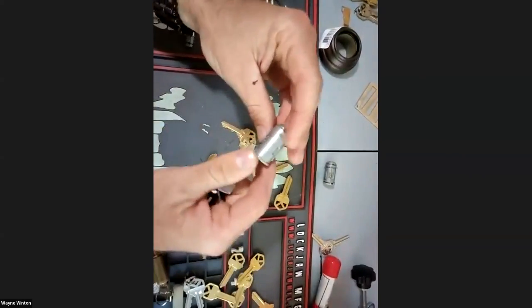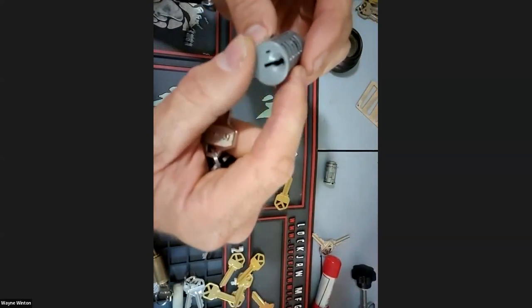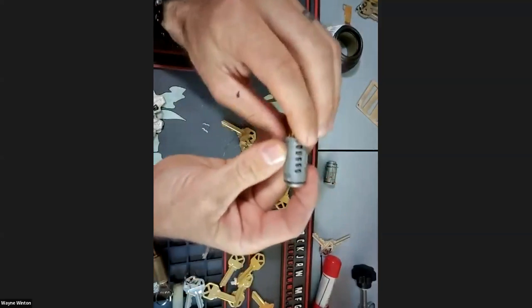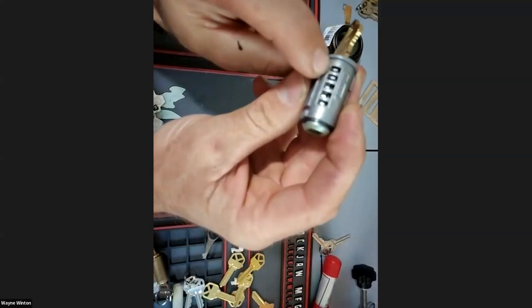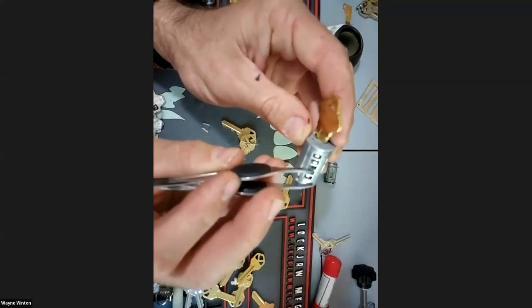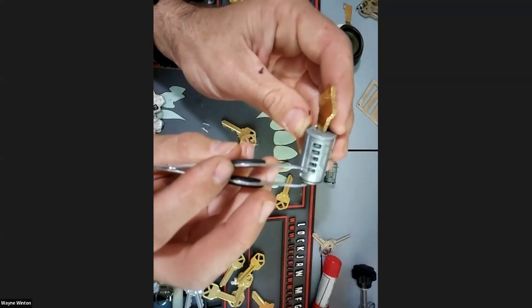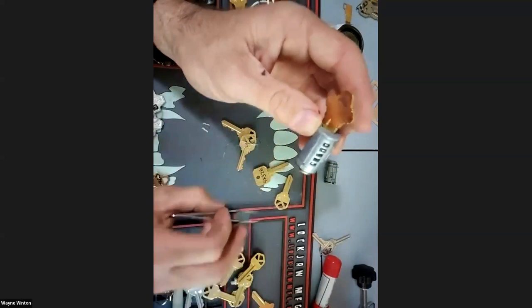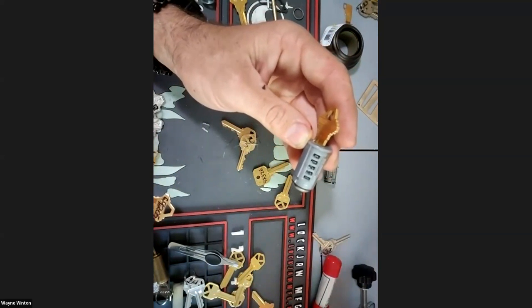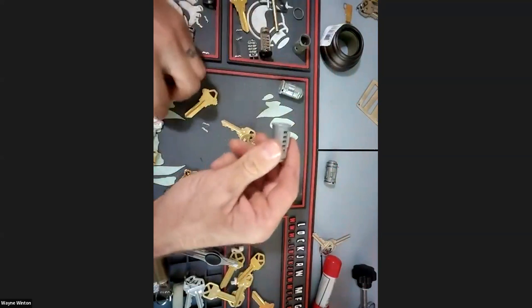Okay, so you can see this wafer hangs out on the bottom. If I insert my cell, you can start to see the differences in the top up here. So we can see a fairly deep cut, probably, medium cut, shallow, very shallow, and kind of a shallow medium cut here. If we were to sight read this out, it would probably be something along the lines of 69205. Okay, so 69205 is what I'm guessing this is actually going to be.